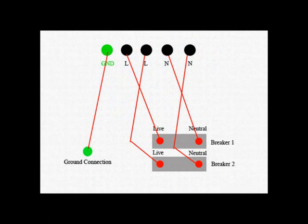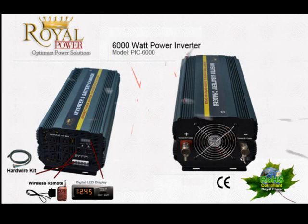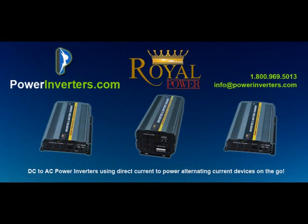A very common question we get with these inverter chargers is: can they be hardwired into the main breaker of the house? They can be wired into the main breaker. For example, the 5,000 and 6,000 watt units do need to be wired into two separate breakers so that the 50-amp charger can work. But it still won't power those breakers. People think that once they connect the batteries and wire it to two breakers, the outlets within the house on those breakers are powered by the batteries — it doesn't work exactly like that. You connect the breakers to the inverter's charger input, and the charger works when power is available, same as the 2,000 and 3,000 watt direct plug-in units. The output of the inverter is the only place you'll actually get output from the batteries.